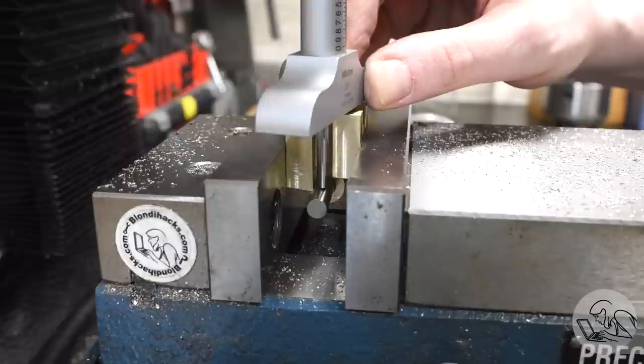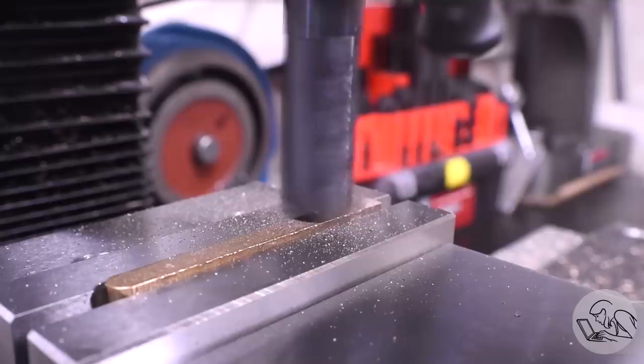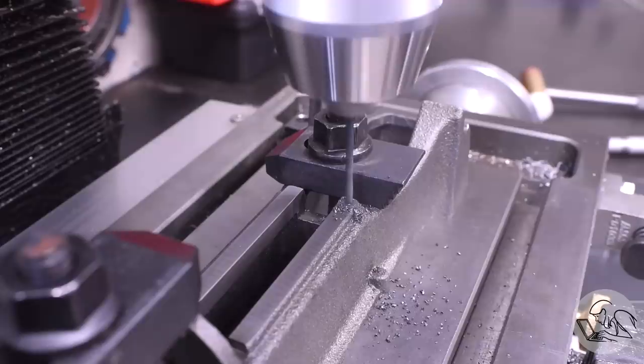The crosshead is a nice fit on there, then the piston rod threads into the end. There are guides on top to hold it in place — they're sprued together, so cut those apart, machine the bottoms nice and smooth for a running surface. Then a bunch of tiny holes get drilled down through — that is a crosshead slide guide. I transfer punched these onto the frame, figuring that physically transferring the marks would give a better fit than measuring with imperfect machining.